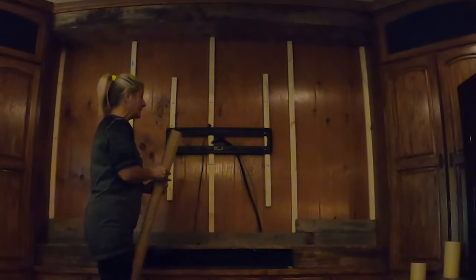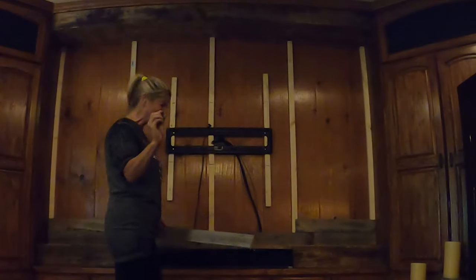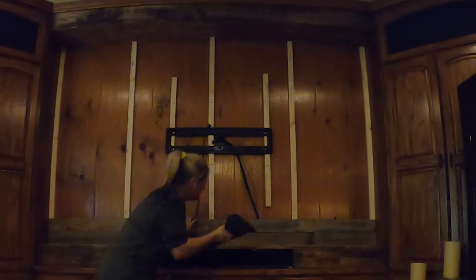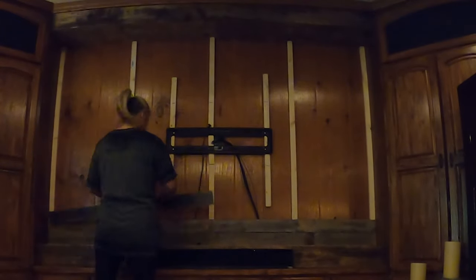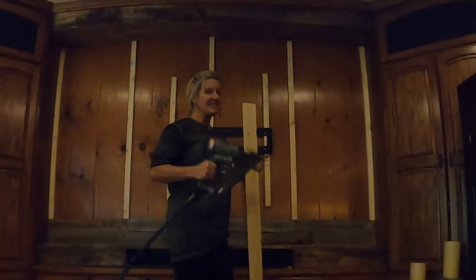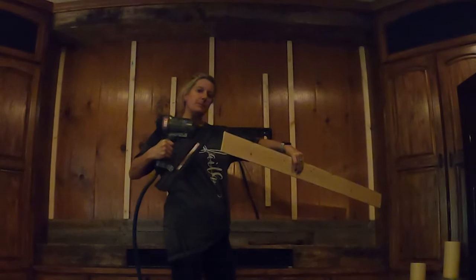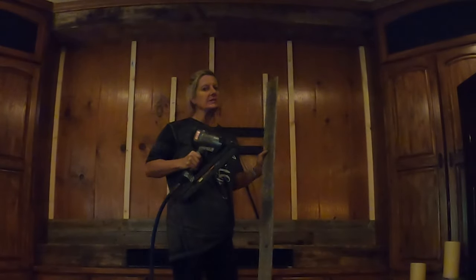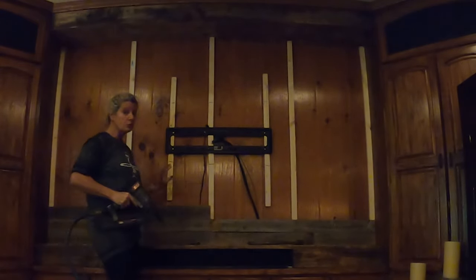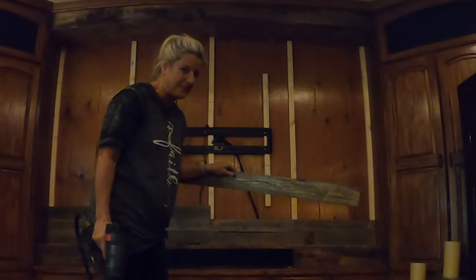I'm having to make more cuts because I have my 1x2s up. At each place you nail, I would put two nails just to keep it from rocking. I did two big pieces at the bottom, then grab a small piece, nail it, then maybe do a big piece, then another small piece — keep alternating your seams. Also, try to put the finishing nails in at an angle, because if you push straight in, the wood is so small it can go through and doesn't hold as well. I really think a staple nailer would probably do even better.